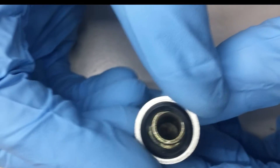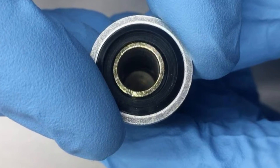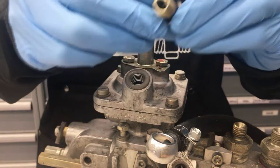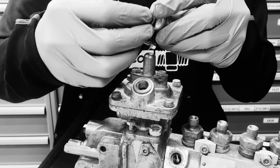The two parts are placed together in an interference fit, where the inner diameter of the rubber seal is slightly smaller than the outer diameter of the mating bolt. This interference aids in installation and retention so that the washer does not fall off during assembly.